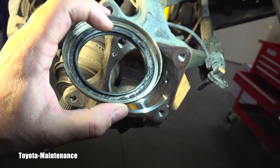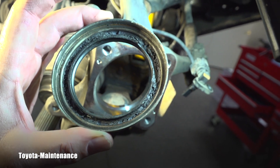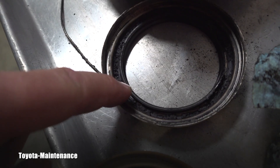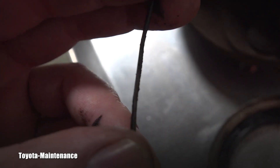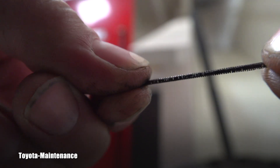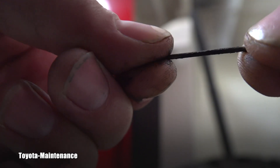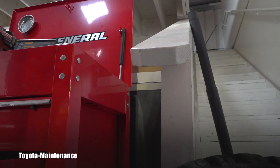Let's look in the light — it's broken right here. I actually found pieces of that rubber inside. Most importantly, inside that seal, to keep the rubber part under tension, there is like a spiral wire — basically a spring. I can show it to you: pull on it by both hands and you can see it has the effect of keeping tension on the rubber part of the seal. That spring was also found broken inside the assembly.